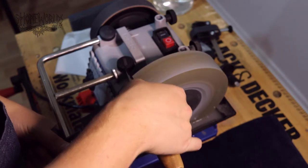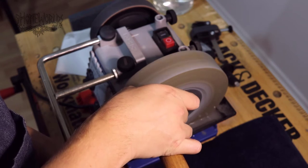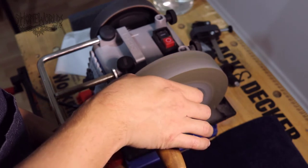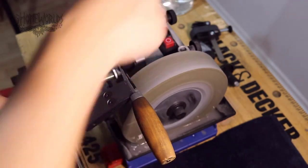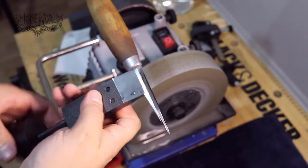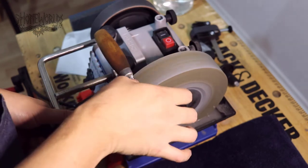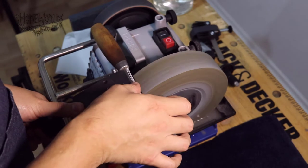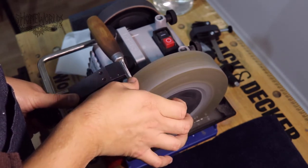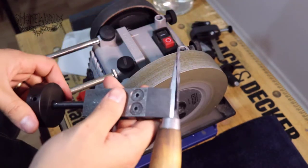With my left hand — my non-dominant hand — I lightly hold the bottom of the jig and keep it flush against the jig rest. I don't want to force down toward the grinding wheel with my left hand because I don't want to bend the jig. You hold it lightly with your dominant hand and guide it that way. I press down on the bevel to make sure it's grinding well. Without a CBN wheel, the standard stone takes considerably more grinding to remove material. Because this knife needed a lot of sharpening, there's quite a bit of pressing involved. You'll also hear the knife sing — the only way to prevent that is to hold firmly on the bevel against the stone.